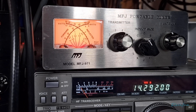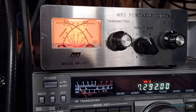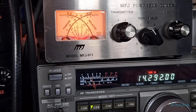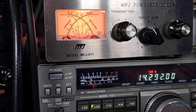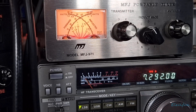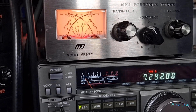Now what we're going to do is go back to 40 meters and tune back in there. So now we've gone down to lower sideband - it automatically changes. When you go to 14 MHz it goes up to upper sideband; you go below 10 MHz so you're on lower sideband, and this automatically changes for you. So now again we're going to find our tuning spot, our matching spot, on this frequency. Let's go into where I'm allowed to use - this is all shortwave, like shortwave radio from foreign countries - so let's just skip down here.